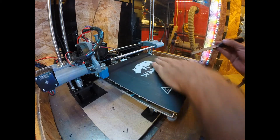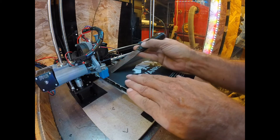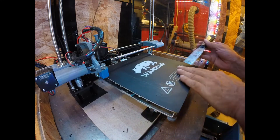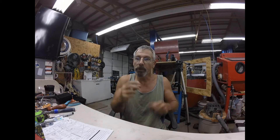Glass is great, but you can't use this sensor with glass. You'd have to go to a different sensor — one that has a longer sensing distance, like one of the round sensors. Round sensors have a longer sensing distance. Once you get your z offset calibrated, you print out that 160mm test pattern and you measure the thickness.